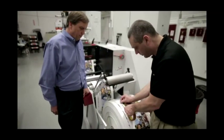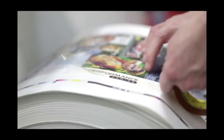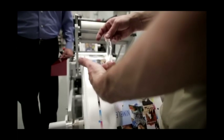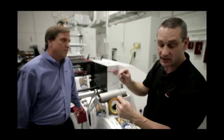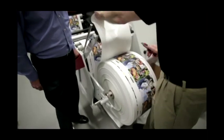I'll go to the next image. I'm going to put my 610 tape across it, give it a second or two to bond to the ink, and peel it off. I'm going to look and see if there's any ink on the tape — the tape is looking very clear. So that is a successful tape test and a successful rub test. I'll put it with my job and keep it for the customer, make sure they're happy with everything.